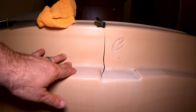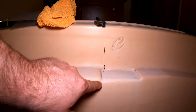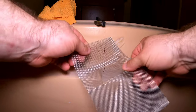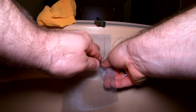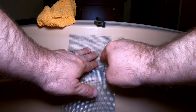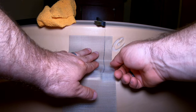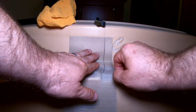Here we have a close-up look of our crack and it's just about to turn, which means if it had gone any farther, we probably would have been done for and had to go heavy duty. This mesh metal came with the kit — you can cut and inlay it, or if it's a really bad crack, you can get plastic rivets and rivet it in on the sides to hold it together. Like if you were going to fix a kayak or a plastic canoe that had a bad crack, this is how you would do it.